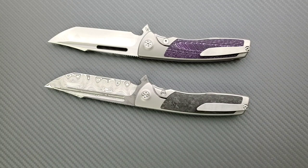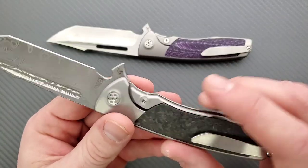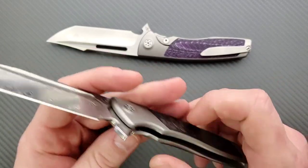Sometimes on an exposed frame lock, if you squeeze really, really hard, it's going to stay locked in, but you might be grinding that lock bar further into the lock face and decreasing the life of the lock bar a little bit. Those of you who own exposed frame locks — you might be thinking, do I have an inferior design? No, you don't. I'm just saying for those of us who nitpick little tiny things like that — it's like, oh no, your frame lock's only going to last 40 years as opposed to 60 years. It's a silly thing maybe to complain about, but I love that that is the case.